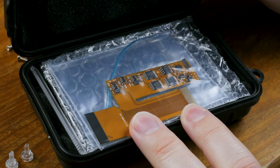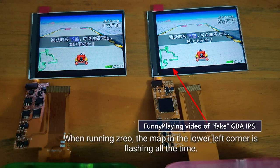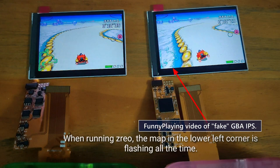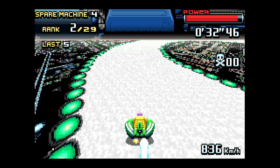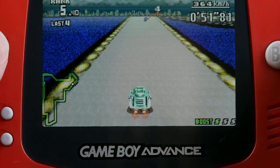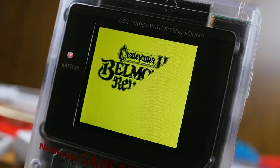That is not to say that Funny Playing's screens are faultless. In all of the Game Boy Advance F-Zero titles, the map in the lower left corner flickers — they point this out as a problem with the generic kit, but that's exactly how the map is supposed to behave, as shown in a direct capture from the GBA Consolizer. Be sure you're watching at 60 frames per second to see it. This sort of flicker is pretty common in sprite-based games, so it's disappointing to see it not handled correctly. In fact, every single IPS screen I bought for this episode exhibits this behavior, with the exception of the R-IPS V3 for the DMG.